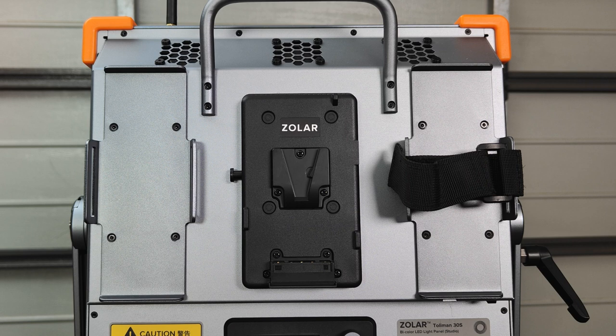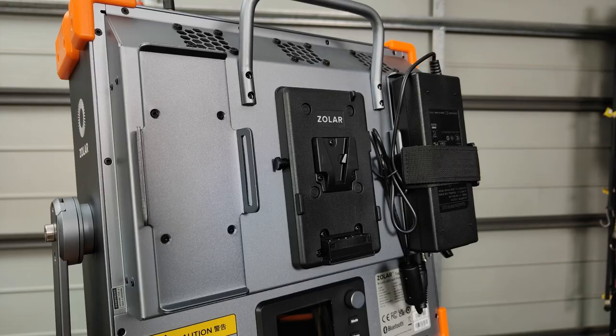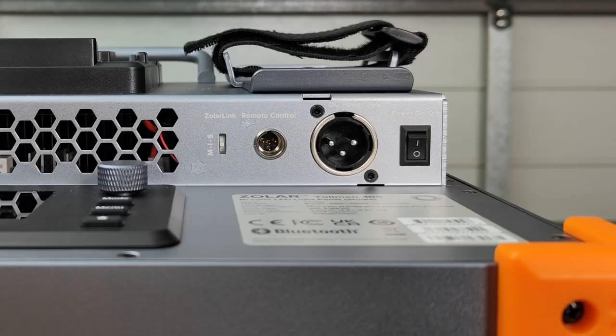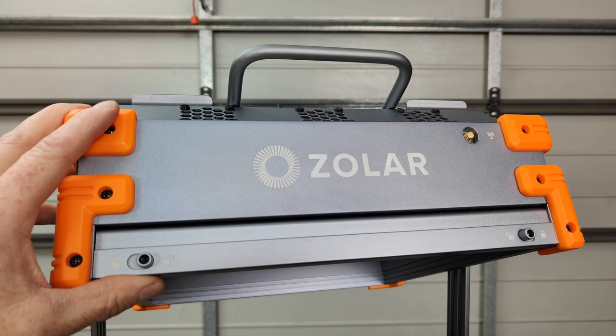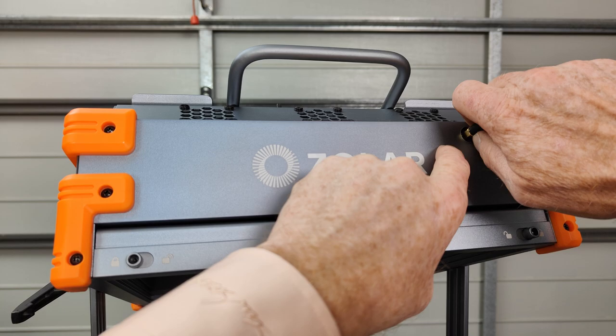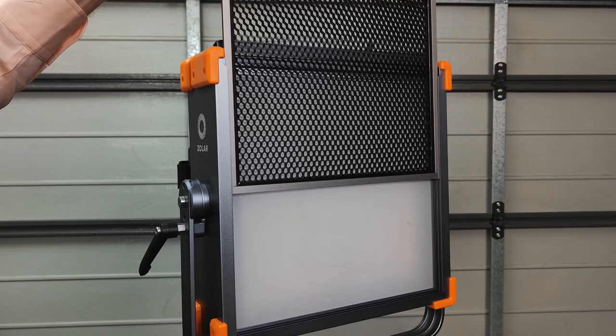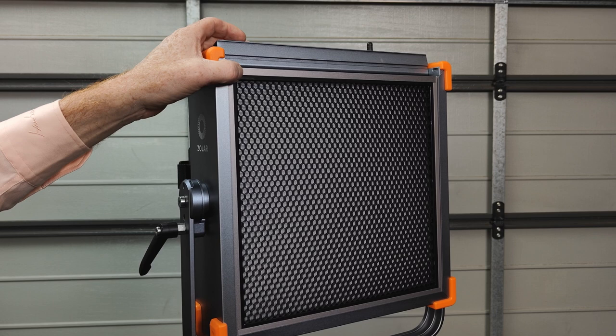There are also two plates for mounting the power supply — you can mount it on the left or on the right. I would suggest mounting the power supply upside down so you can easily access the locker on the IEC lead. Even with the power supply on, this is still a very lightweight unit, so you could leave it attached when you swing over to battery operation. On the bottom of the rear plate, we have inputs for the remote control, DC power at 36 volts, and the on/off power switch. On the top of the light, we have the opening for accessory slots with solid locking mechanisms, and the terminal for mounting the antenna. On the front of the light, we have the LED array with its native 25-degree lenses. There is a lot of space between the LED panels and the front diffuser to ensure an even distribution of light. The front also has three accessory slots for neat and secure mounting.